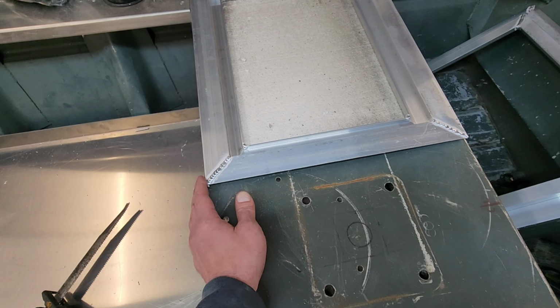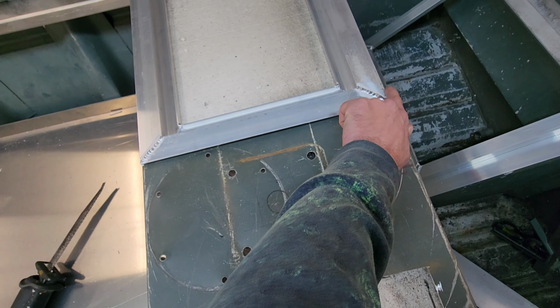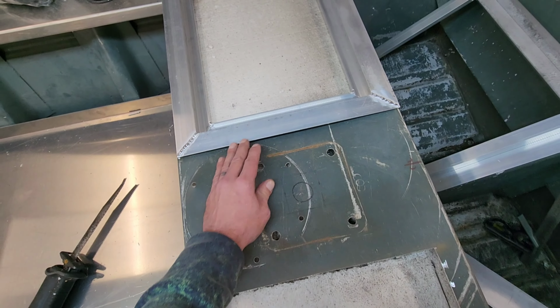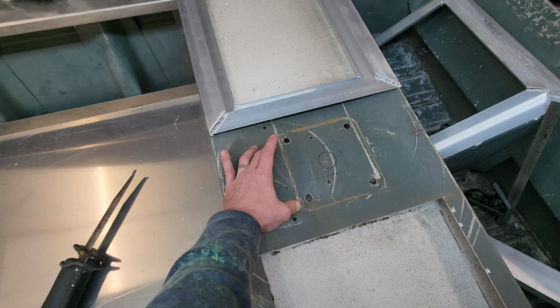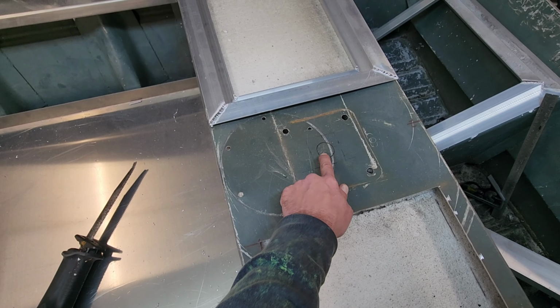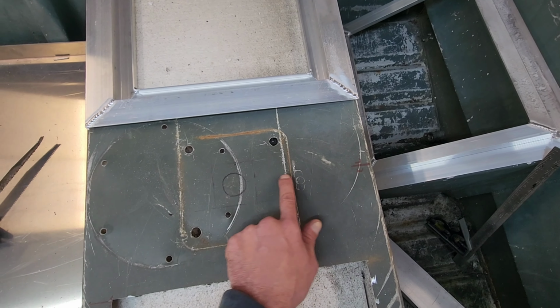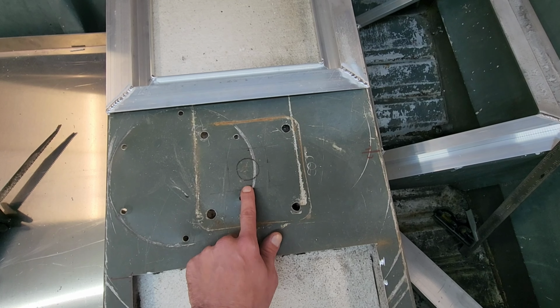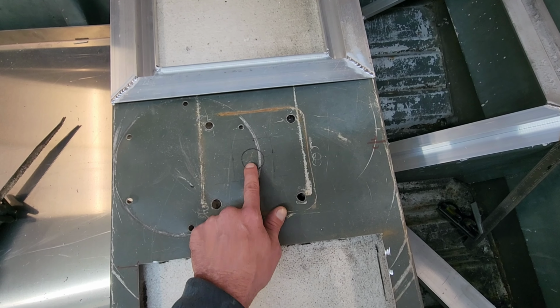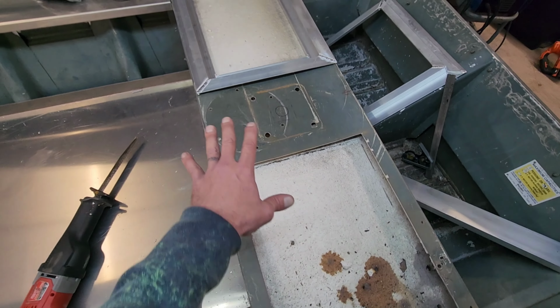Now, this hatch is specifically made for this back bench seat. You see how it's flush here and on this backside? I got a little bit of play this way. I want to leave enough room for his seat pedestal base to sit in here. This seat pedestal base that was marked out in here, it's off. It's not centered. The center line is here, and this thing is probably sitting this way about a half inch. So I'm going to move this back there. I'm going to set this exactly in the center where it needs to be. I'm going to drop both these hatches in here.